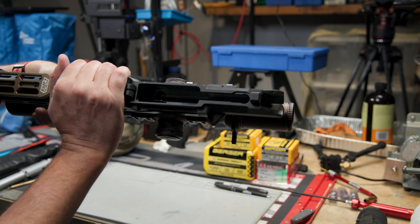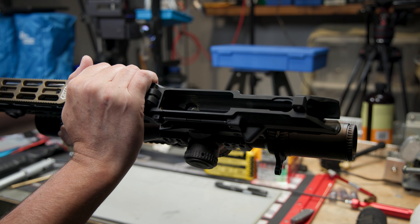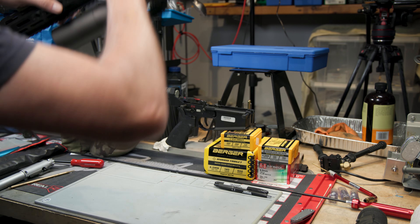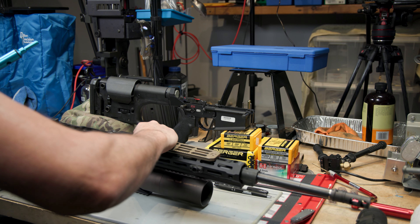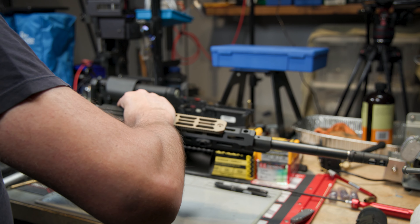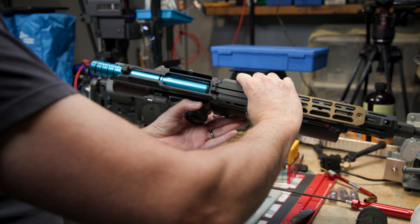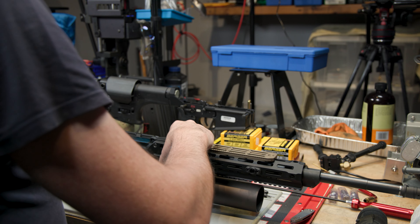So that's what I'm going to do — just file it off and see if I can get a better fit, top to bottom, the upper receiver to the lower. I'll do it here on camera, but first I'm going to insert a bore guide into the upper to keep the shavings from going inside.